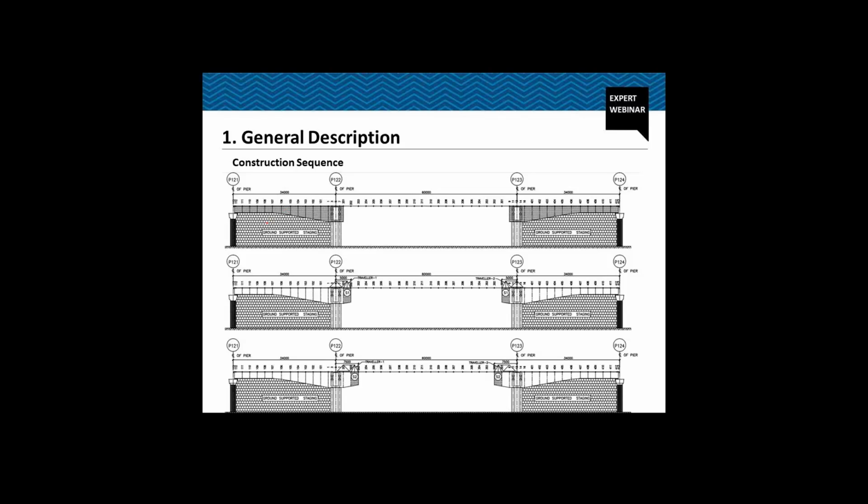So what we are doing is keeping this ground supported staging until a few stages more, so that we cast enough of these segments on the cantilever sides that the sagging moment at this part is mitigated, and the requirement of bottom tendons in this zone is bare minimum.